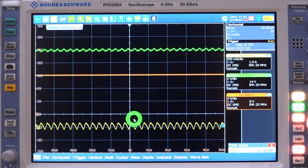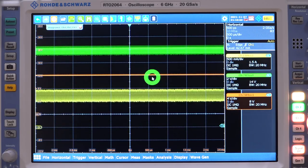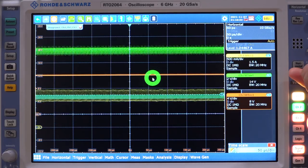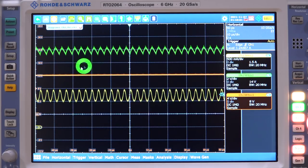Channel 1 is the input current to the DC-DC converter, channel 2 is the input voltage at the board, channel 3 is the output voltage. Under no load the input current has ripple from switching behavior of the micro module, inducing ripple on the input voltage. The SMU is sitting at 20 volts average, and the output on channel 3 is a constant 12 volts. Under a constant 2-amp load, the average input current increases significantly to provide about 24 watts at the output, and input ripple grows to about 500 milliamp peak-to-peak, but output voltage remains nicely regulated.